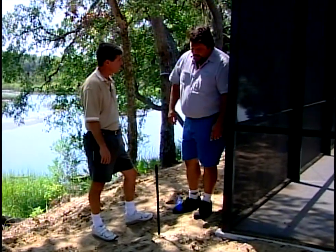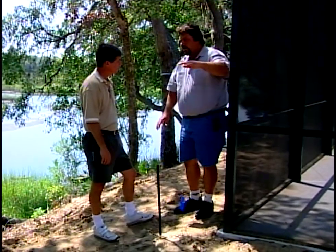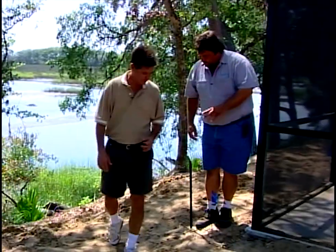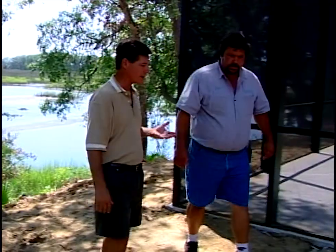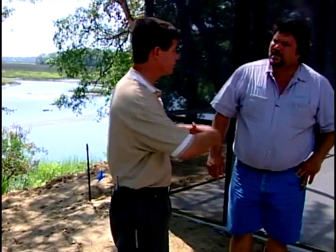When you're done with your landscape, we come back on a courtesy visit and adjust all the heads up or down according to your landscape, making sure the heads pop up through the turf. How often would you recommend a homeowner check their system? Ideally, if you had time every week, you should do a quick check, but at the very least once a month you should go out, take 20 to 30 minutes, go through the zones, and literally walk them. Check your heads for clogs and adjustments, because things do get out of adjustment. During droughts or drier periods, you may notice dry spots, and that's when you can make adjustments.